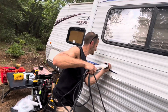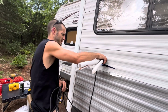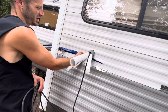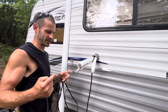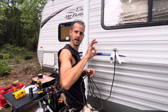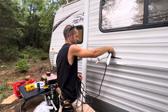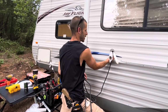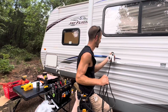That's just a sleeve to cover up the inside of the wall? Yeah, so what I'm worried about here is since this exterior is metal, it's kind of like whenever you run an electrical wire into a metal junction box, you want a connector on there so it definitely doesn't rub. So I'm going to trim just enough of this so it'll sit down here, so it doesn't vibrate and rub at all. Gotcha. I just wanted to make sure it fit up inside of there.